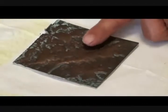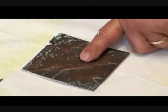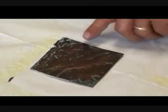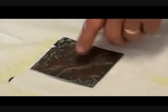So the next thing would possibly be, the B or C coat does not have to be sealed, but if you've got the C coat and you've buffed it up, you've now exposed the metal, so it's going to oxidize like real metal, so then you're going to want to seal it if you want it to look like it does at the time you've buffed it.